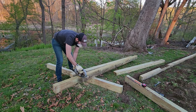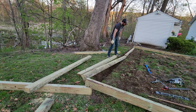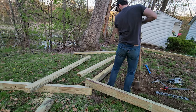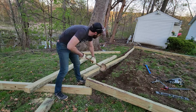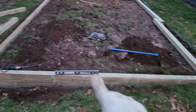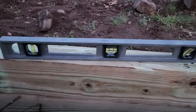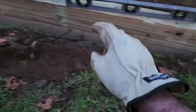With all that homework done, I started constructing the perimeter of the pad. For the back wall, I used two 10-foot beams and two 8-foot beams stacked and set into the dirt about 4 to 5 inches. For the sides, I used a 12-foot beam with an 8-foot beam below it at the low end of the pitch. I got this 12-foot side to be nice and level — a 12-foot 4x6 on top and an 8-foot 4x6 underneath.